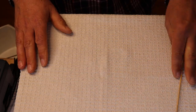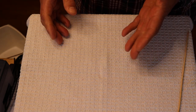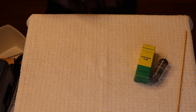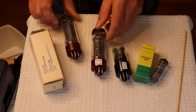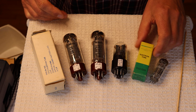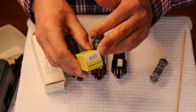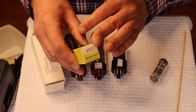Hopefully that will help you advance your interest if you want to get more into designing in electronics. A lot of tubes came in, so let's just load this all up. As you may know, Charles has recently gotten really big on the 6GU7 as a good, viable, affordable-sounding replacement for the 6SN7 GTB. It needs an adapter, but a lot of 6SN7s have just become too expensive, and the adapters aren't that bad.